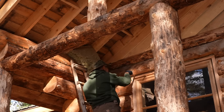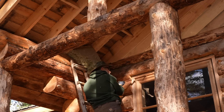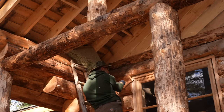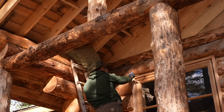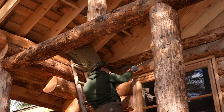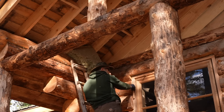Squirrels are getting in here, so I need to figure out how I'm trimming this piece out. I can't make it a solid trim and nail everything tight right here because it's going to settle. I need a gap so that this trim can come down over top of the vertical trim — the horizontal one slides down over top of the vertical one, which is stationary.